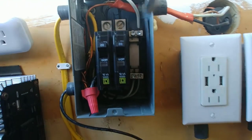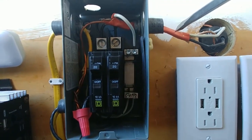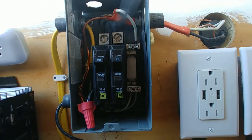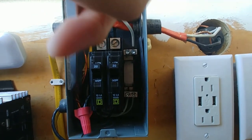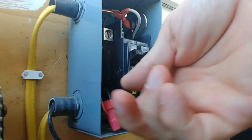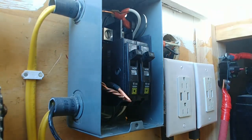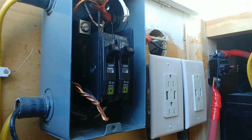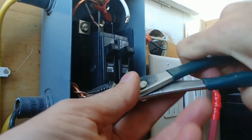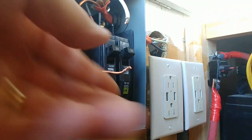In order to get started pulling this apart, I'm going to undo all the wires attached to this orange wire right here — that's going to be a white wire, a black wire, and a bare copper wire. The black wire is right here, attached in this area, and the copper wire is twisted into this copper wire here, so I've got to remove this wire nut. I'm going to pull the wire nut out and untwist it counterclockwise. That should expose the bare copper and I've got to untwist that copper wire. I'll take a pair of pliers and turn it opposite the direction it was twisted. Got it loose.